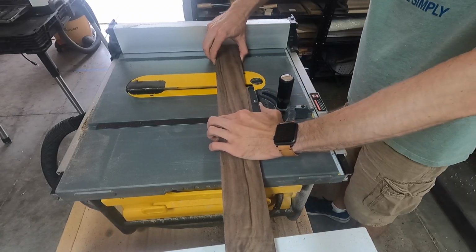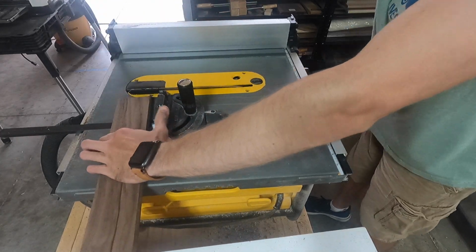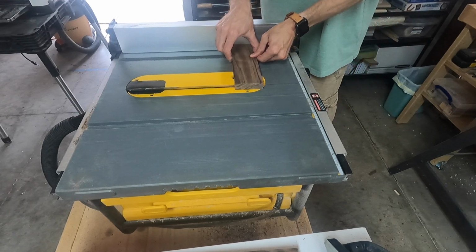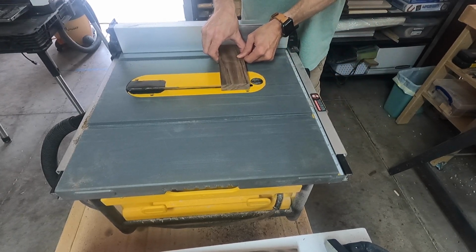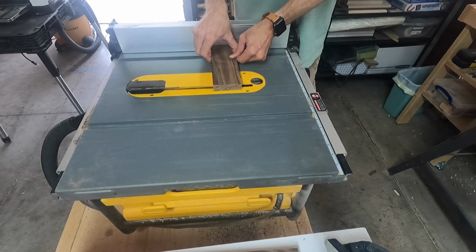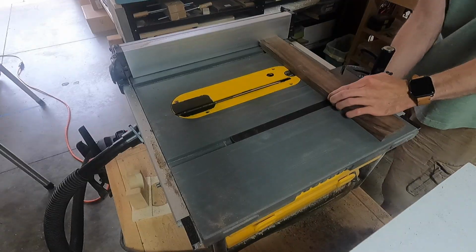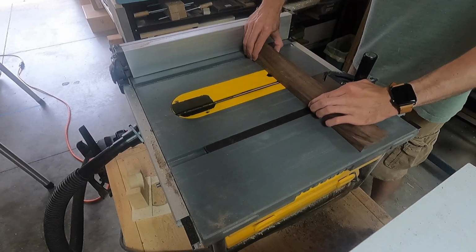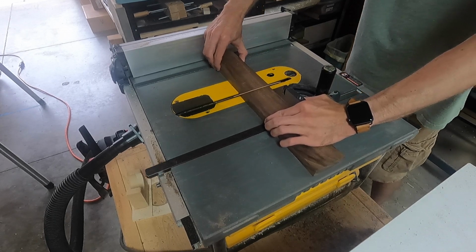This, I'm calling it a glasses case, but all it is a box. I think there are people who they'd like to get into woodworking or they'd like to get into making things, but they have a mental barrier of these fancy looking things that people make, but just know that it's a box. All this glasses case is mitered corners like you're seeing right now, cut 45 degrees on the corners, glued it all up, and then to reinforce it, I just did dovetail splines.